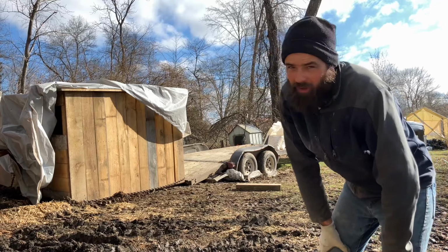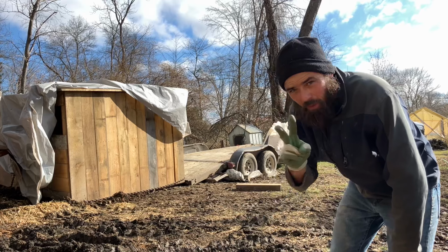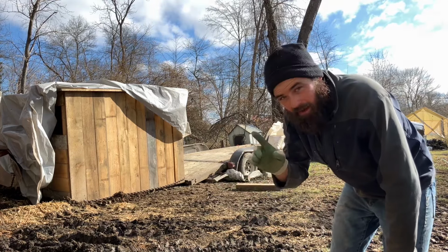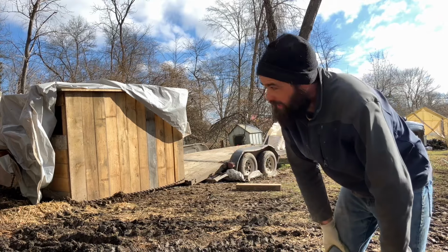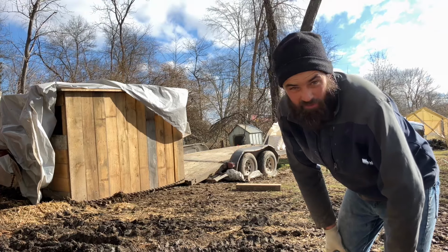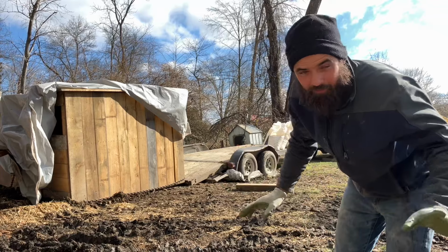Whew. Running that digging iron is a little tricky. Don't do this alone. Make sure you've got two people. Be safe. Don't break the safety rules like I did. Now, I did have the tractor in low range. It can't move very fast, but say the tractor front end was gonna come off the ground, there'd be nobody there to push the clutch in. Do not do that. If you do, don't blame me.